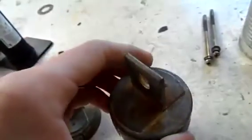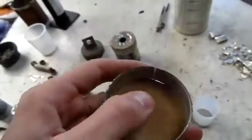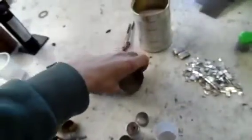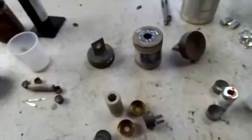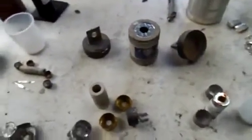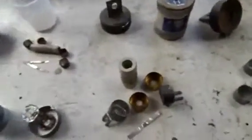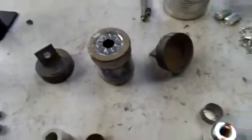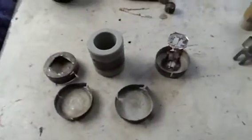A little warning: do be careful with really old fuses because the gasket will be made of asbestos. In these newer ones it's just paper, cardboard, or plastic, but watch out for asbestos — you really don't want to sink a grinder wheel into the end of a fuse and have asbestos dust going all through your shed or garage wherever you're working.